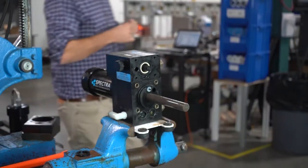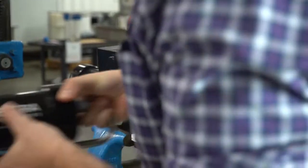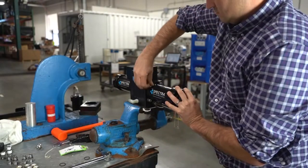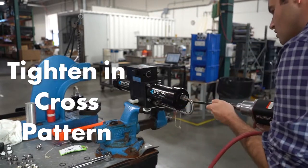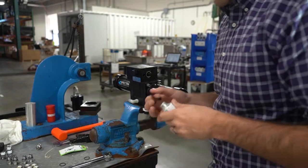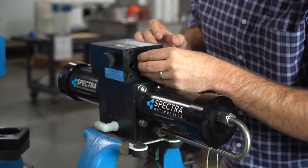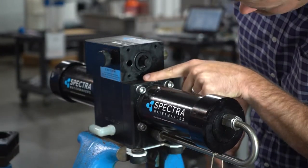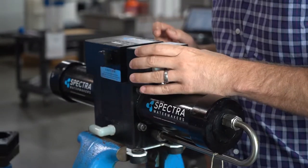I'm going to need another cylinder O-ring — a little bit of grease on that — and put them to the top. We reinstall in reverse order. I can use silicone grease again to stick some of the stuff on the side here. Stick that spacer ring right there, this little O-ring here. We've got one, two, three, four, five — including the spacer. I'm going to put this back on.